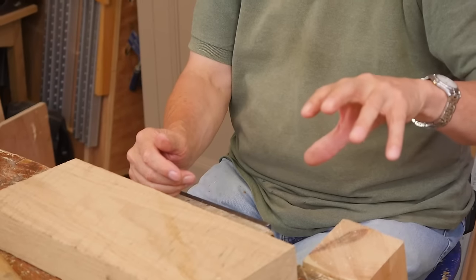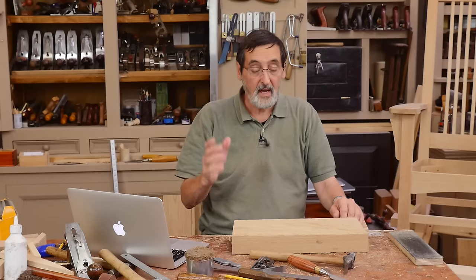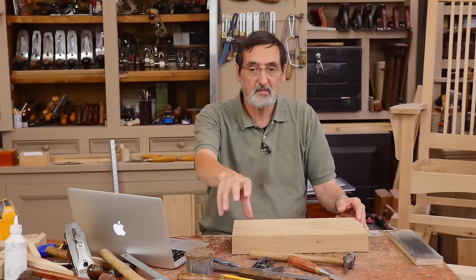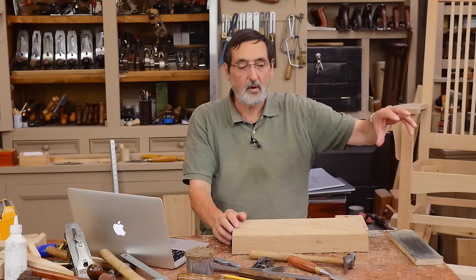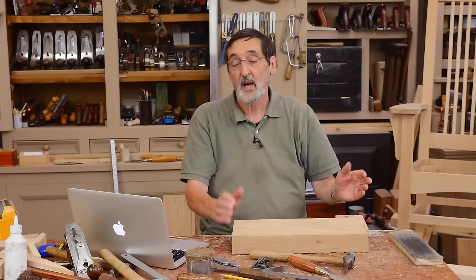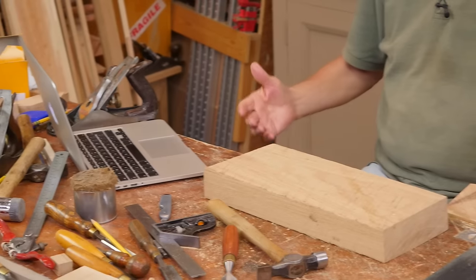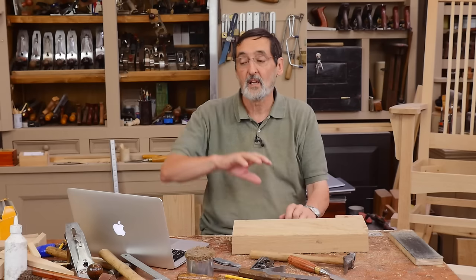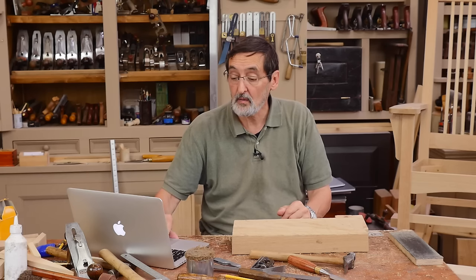What you find is it's much better to maximize the surface area where you grab your tools from. Being right-handed, I like all my tools on the right-hand side or in front of me. If I were left-handed, I would want the surface area for tools to be to my left. So I would move the vice to the opposite end of the bench — 9 to 12 inches from the end, which works fine. I find it better to have it offset so all my tools are conveniently placed.